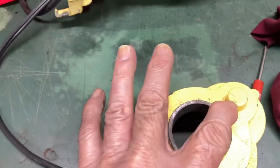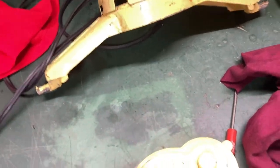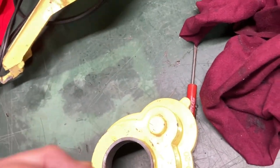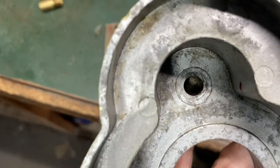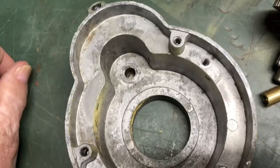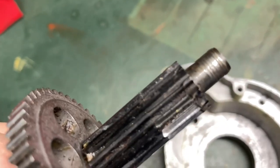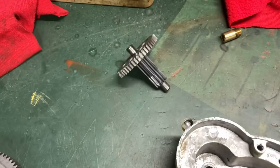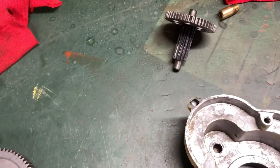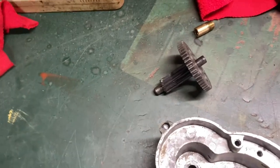What I did making that bushing: I drilled through this the whole way because I wanted to make sure I had it centered, with a 25/64th drill bit. Then I pressed this homemade bushing into that cavity in there. It works. I haven't made ice cream with it yet because we just got done making some, so in the next week or two I'm going to make some ice cream with it and see how it works. I'm going to just grease this up real good and take a chance on this worn gear. If it starts slipping, I'll know what to do — I'll just order a gear. I'm glad I checked it out because they are different; there's not the same gear in all of them.